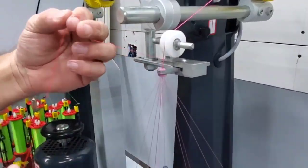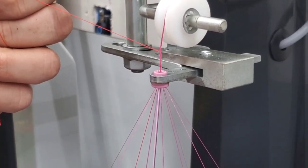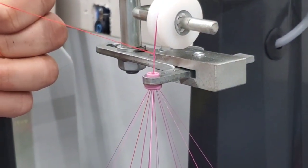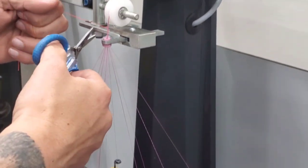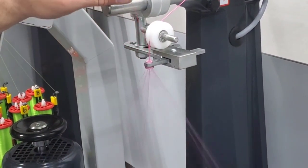And if you're talking 200 pound hollow core, take 12 into 200, that's what one strand is that you're missing. So this doesn't become 200 pound anymore, and it leaves a vulnerable spot. That's why we cut it all the way out. And overseas stuff, as you saw in your last video, they cut right here. There are some of the bigger ones that are making the big ones, what they'll do.